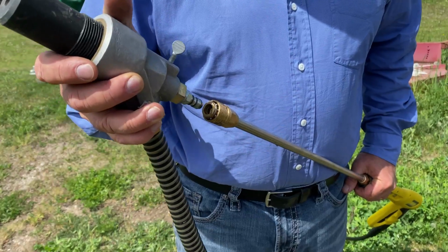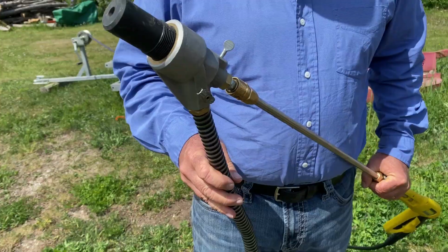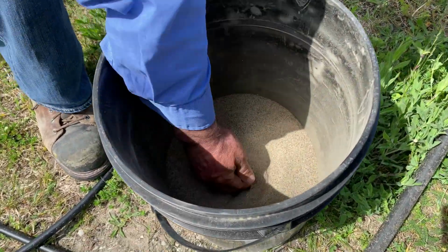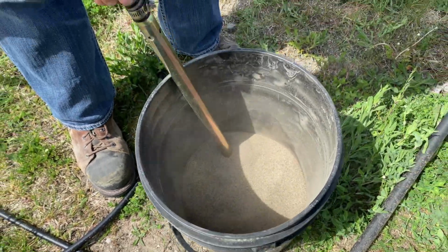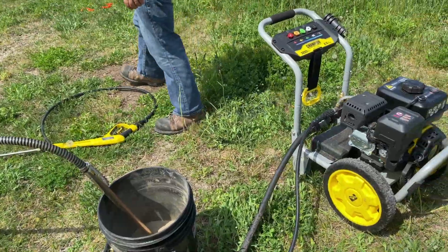If you need to prepare metal for finishing or refinishing, then a pressure washer with something called a media blaster attachment is something you should know about. Made by several manufacturers, these fit on the end of any pressure washer wand and include a large diameter hose. Stick this hose into a pail of sandblasting media such as glass beads or coal particles, and it gets drawn up into the wand tip by suction created by the movement of water through the tip.